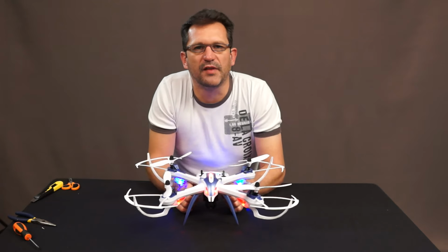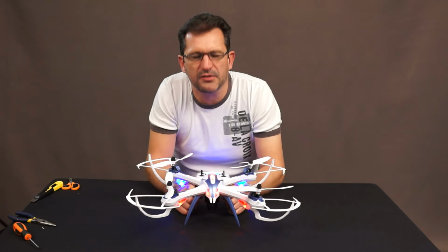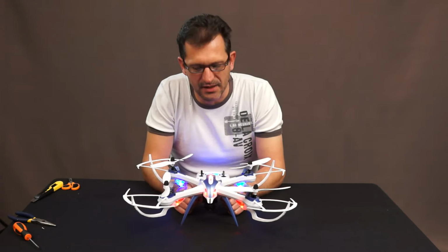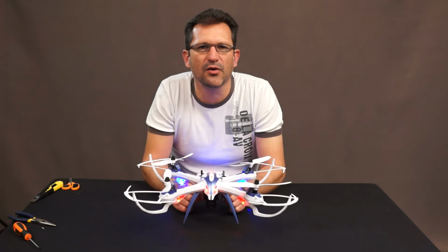Alright, now if you've done that, you don't have to do the tilting thing. I just like doing it because it varies the speed a little bit and just gets that grind on the brush so that it seats very nicely. And if you've done that for 3 minutes, your machine is now ready to fly.